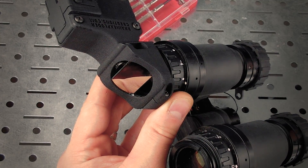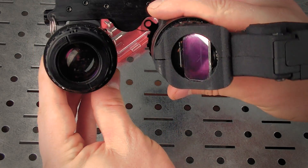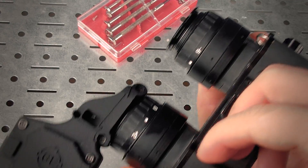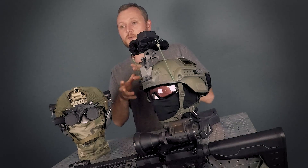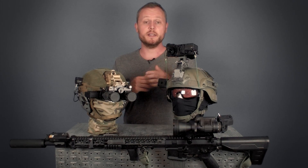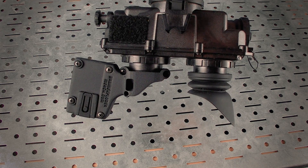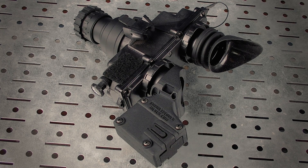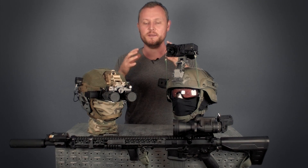The design allows you to easily mount over your left or your right eye depending on your preference. The system is simply friction fit — there is no permanent damage or any modifications you have to make to the goggle. All you have to do is supply the eye cup ring. The recording unit is battery powered and the battery is interchangeable. The internals are sourced from a Runcam 2 camera, so it's compatible with Runcam 2 batteries and the Runcam 2 recording app. The Runcam app allows you to have a live view of what you're seeing, change settings, or format your SD card.